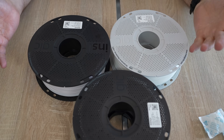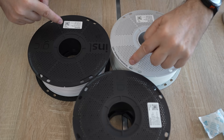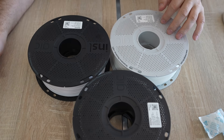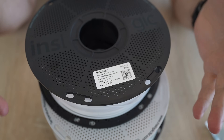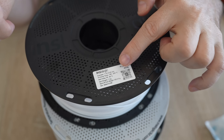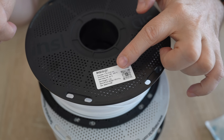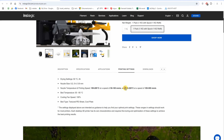I really like these plastic spools — they have drying information on them. The maximum temperature resistance is 70°C on the spool for PLA and PETG, and 90°C for the ASA spool — very important for the drying process. Checking the print settings on the spool: for PLA, print temperature 195–205°C, bed temperature 50–60°C. More information is on the website, though I think there is a mistake — I believe they mean bending strength rather than impact strength. PLA is stronger than ABS in this. Pre-dried means I can use it out of the box.